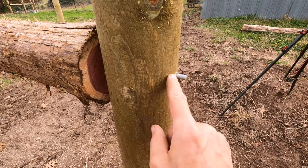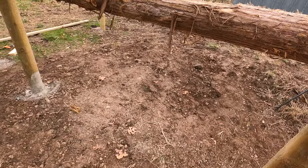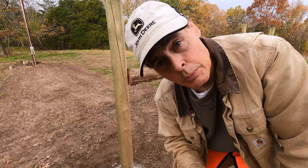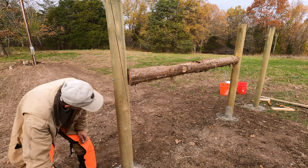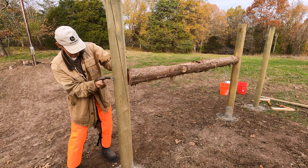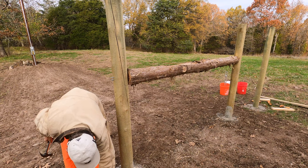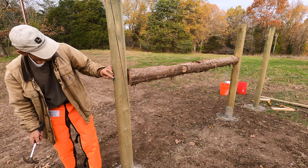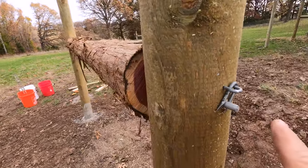Just a little bit of this pin sticking out on this side so I can hold my diagonal bracing wire. I'm using 1.5 double barbed staples. This creates a channel for the wire to rest in and not cut into the wood. I've shifted my focus from working here to over there.